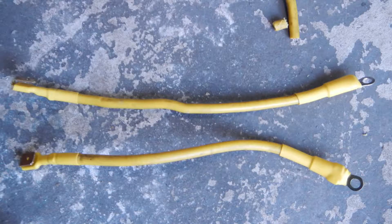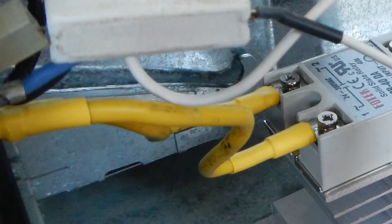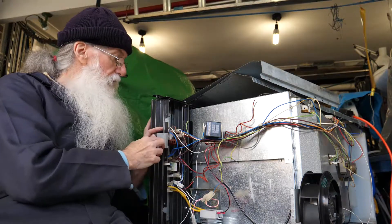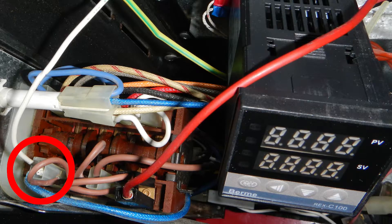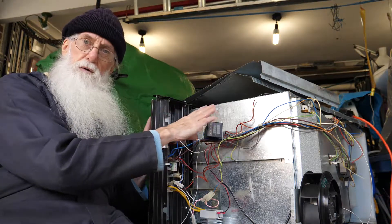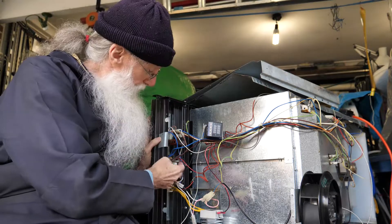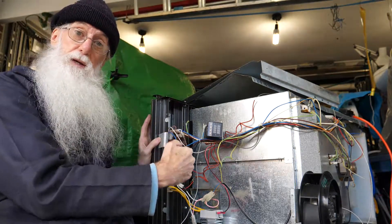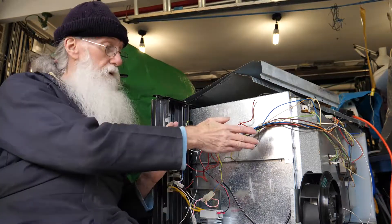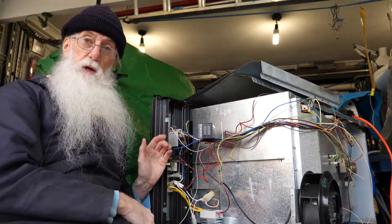That's why I've added the larger yellow cable — thicker cables — either side, just by testing. Then you have to power your temperature controller. There's no power unless the clock is set, and when you go to tap into the actual selector it doesn't work unless the oven is on. So you have to tap into a position where when the oven is switched on you've got a 240-volt connection. You may have to tap into the mains — piggybacking the connection where the live goes in and where the neutral goes in. Once you've done that, you've checked your wiring and checked all the elements, and everyone's working okay.